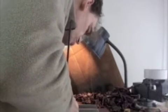So, if I can show how a fret works, what I do is I come in, I center my saw over the fret mark, checking that it's exactly on. And when it is, with a few cuts of my Japanese saw, I have a beautiful, clean fret slot. One down, 21 to go.